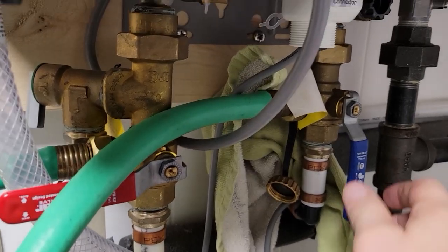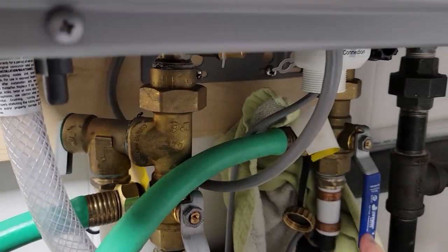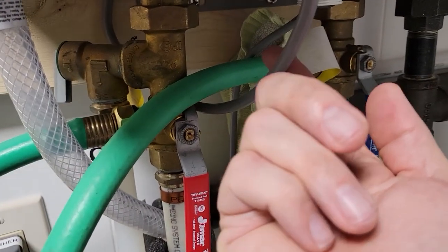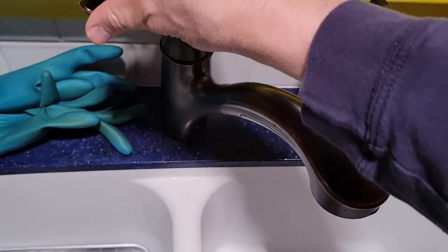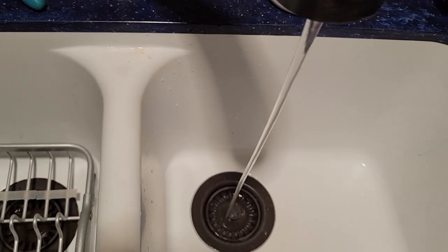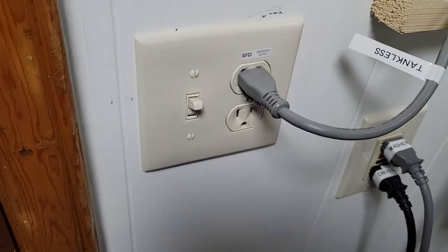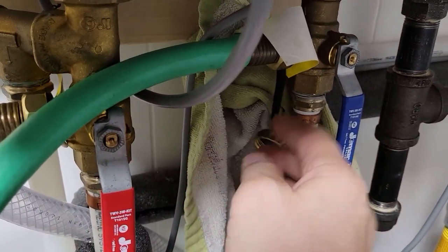When you're down to your final flushing, close off the hot water valve. Now you have cold water coming into the system, returning back into the plumbing and bypassing the hoses. All you have to do is go to the closest water fixture and run the hot water so that any air in the system gets purged out. Once you have solid water coming out of your sink, it's okay to plug in the unit and you're back in business. Make sure to check all your fittings once you remove these hoses and attach all your caps, and confirm there are no leaks.